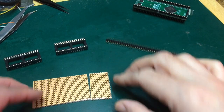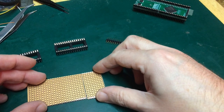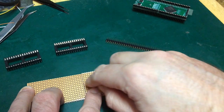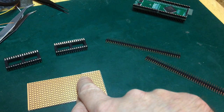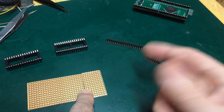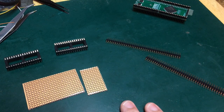You can see that I've had the hacksaw to this, that way around. I've had the hacksaw to this to make this, and what I've done is I've cut down the line of holes. The idea being, obviously, there'll be copper on both sides. So when I come to solder this, I just have to make sure, one, it joins up, and two, I flood both halves with solder, such that it's a good electrical contact. So that's what we're going to try.